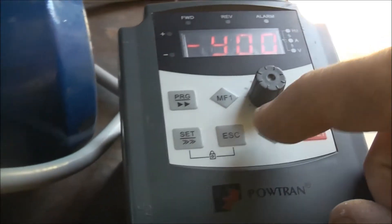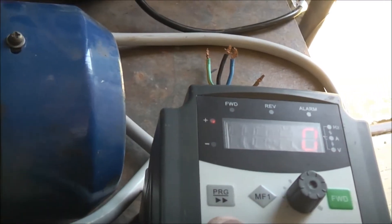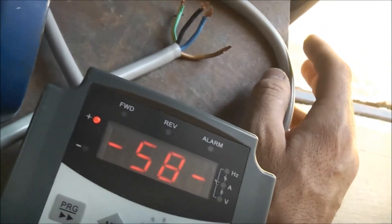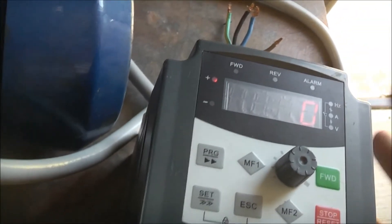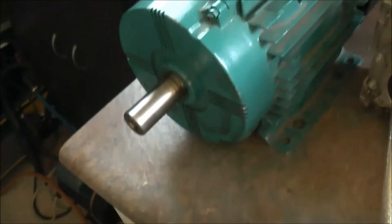Y00 which is a factory reset - go in there, hold on, set it. Now it's reset the drive. Set it up to 100, it just says OK end. Let me save that setting - so that's the factory reset I'm doing now, and that should be reset. Now we go back to where I was, there's my frequency set at 50Hz. Still does it - wonder why. Everything's been reset there, still does it.